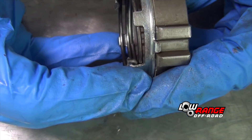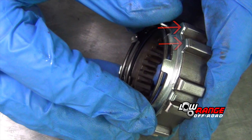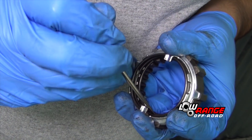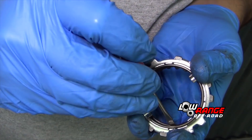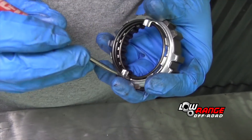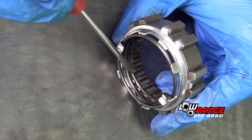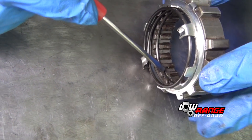Put the parts together ensuring that this tab fits in a groove and all these tabs align with the corresponding teeth. Then push the spring end down into the clutch groove with a standard screwdriver. Once the end of the spring is located properly, work the rest of the spring into the groove as shown. Be sure the end of the spring is located by this groove and that the spring fits all the way around in the groove.